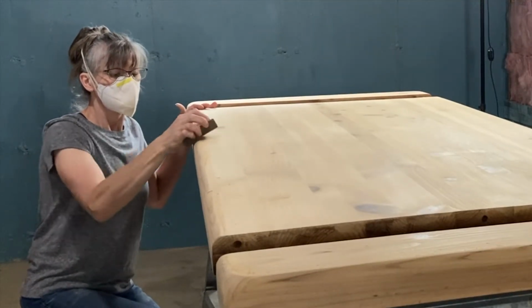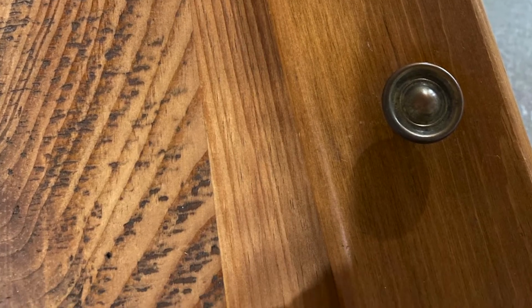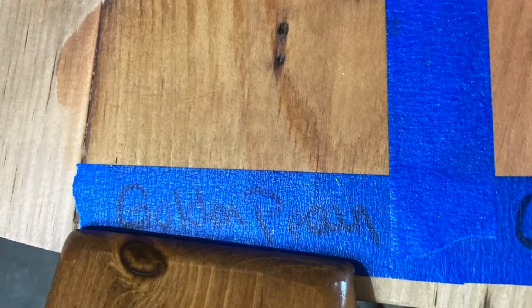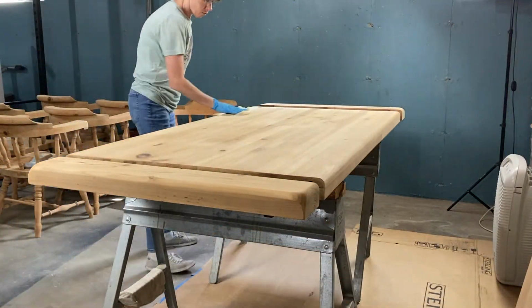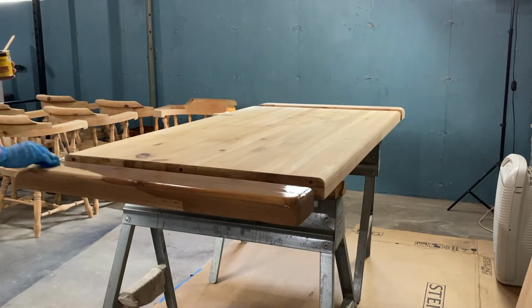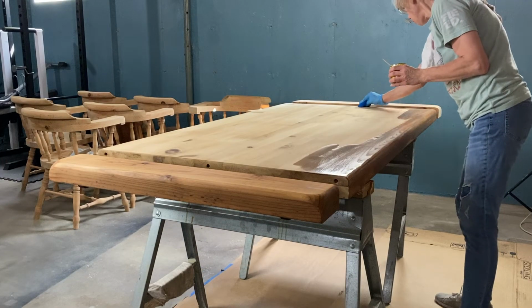Now that everything looks nice and smooth and completely raw, it's time to stain. So I do several test samples on the underneath of one of the chairs. 3 of these stains were very close to matching a drawer provided by the clients that belonged to a matching hutch. After a comparison to that, the clients chose fruitwood. I do one last debris check with the tack cloth before starting the staining process. I started on the table, then moved to the chairs.